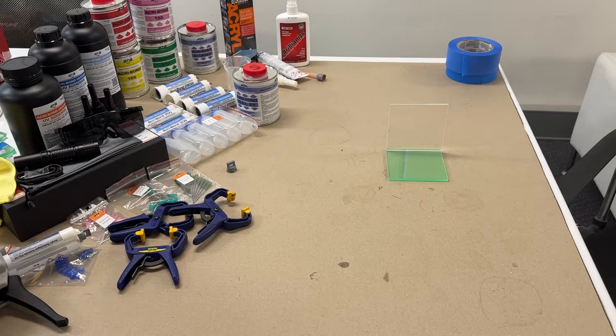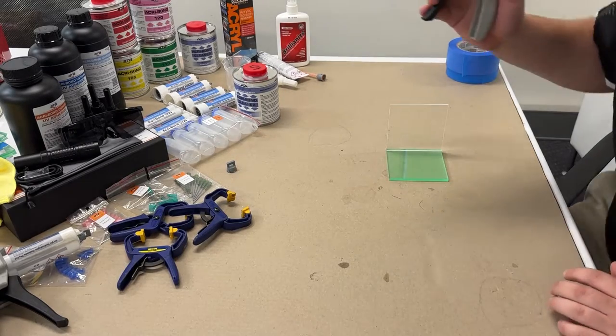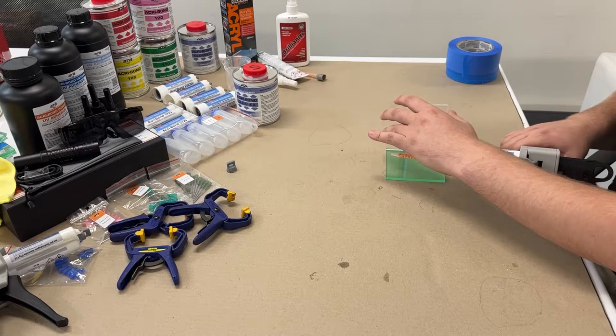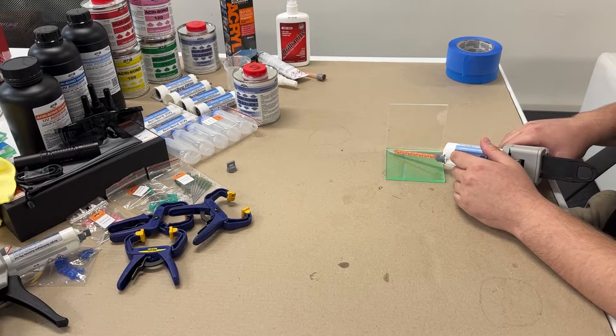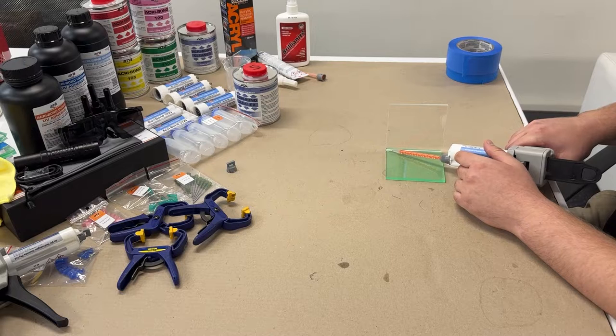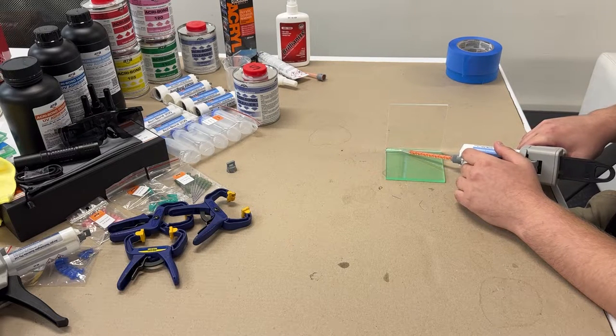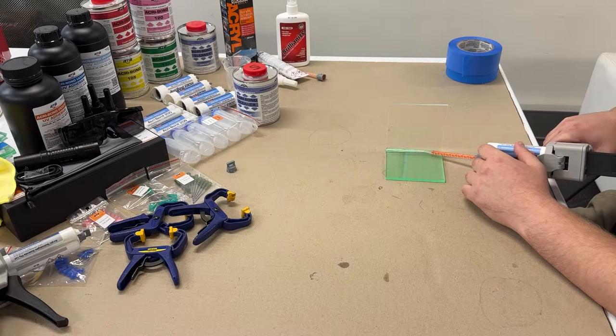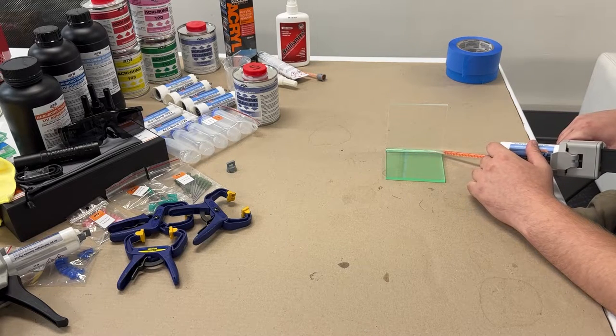Here we set up a butt joint. Very simple to do. All you have to do is run the glue on both sides of the face. You can also tape it up as well to be precise. You would need two bits of tape, one on each side going diagonally in opposite directions to hold the tension on each side. The glue will bond the two faces together as well as flood the joint at the bottom.